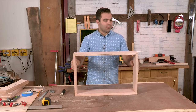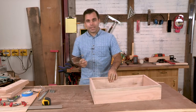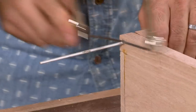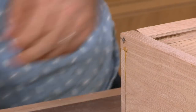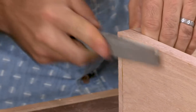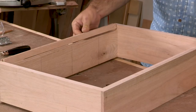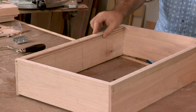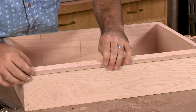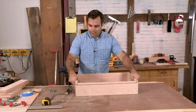I've already cut off one of the pins and want to show the process. I'm using a coping saw — use a blade that's been around a while because cutting aluminum may dull it for wood. Then use a metal file to flush it up. You'll end up with a nice shiny pin on top. And we can test our hinge — it works! We spaced it so the hinge rail doesn't even need chamfering on the back corner. This is a pretty cool, inexpensive way to do a hinge.